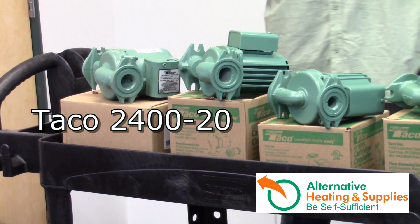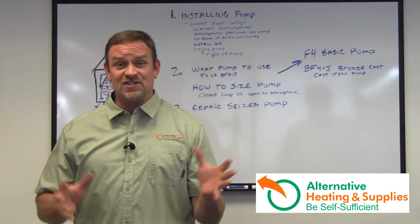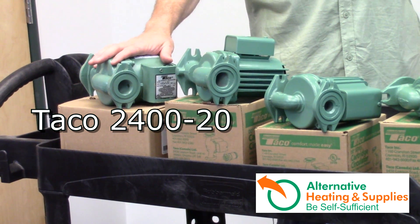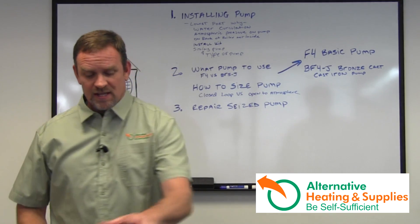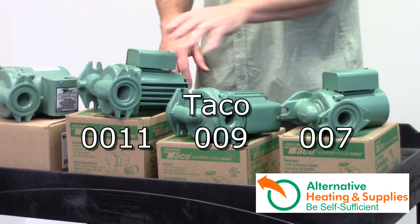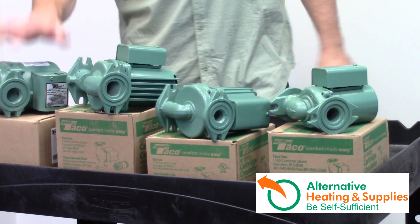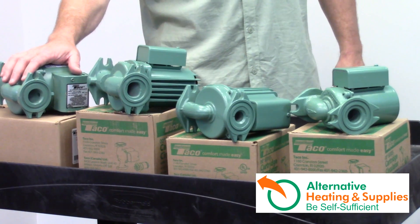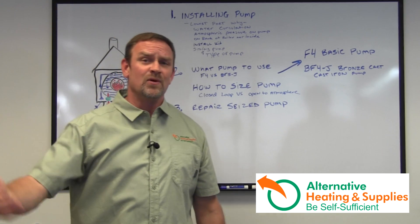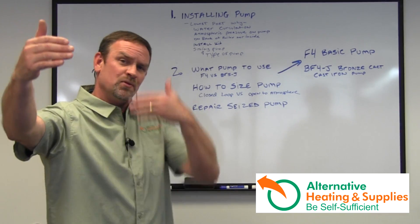The 2420 wood boiler pump is the first pump ever made specifically for the wood boiler application. It is designed to handle unequal pressures on the front and back side. This pump has a three-year warranty because it's designed for the wood boiler application, whereas other pumps only carry a three-year warranty in a pressurized closed loop environment — which we are not running. So I offer a one-year warranty on the others, but I'll honor three years on this one. This pump is good for 150 feet and up — depending on your loop, 300 to 400 feet. At those extremes you might need two of these, one on each side: one push, one pull.